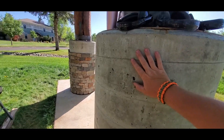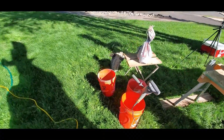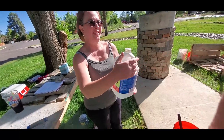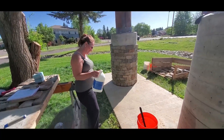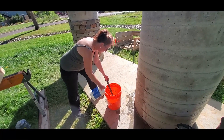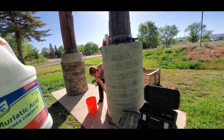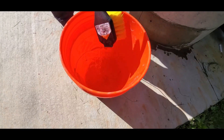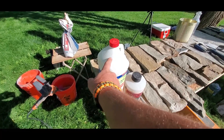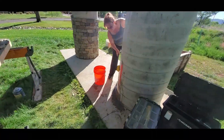So what we have to do is wash it off. We're going to do acid — muriatic acid. I got this from just one of the big box stores. All I do is put about four inches of water in a five-gallon bucket and then half a cup of muriatic acid in that. That seems to wash the surface pretty well.